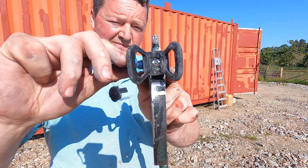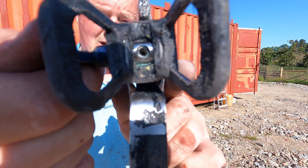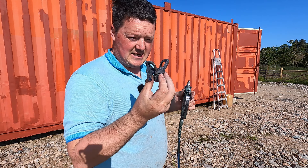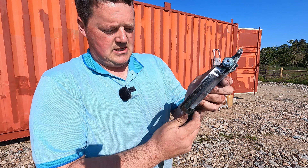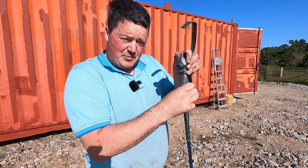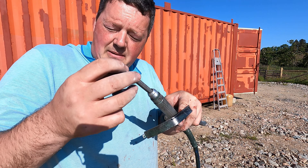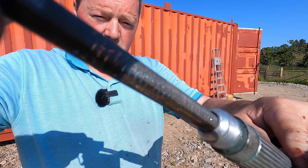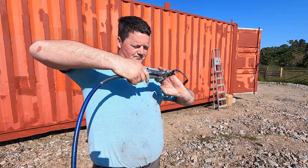That's you spraying. Whenever you get a blockage, you just turn it 180 degrees - spraying, unblocking, back to spraying. I'm going to take and clean that out because this is a key element. It's not too bad, it is sitting centred - I'll give it a wee extra clean anyway. There's a filter inside the head of the gun. That spray tip is a 517 jet - real standard, it's a heavy coarse one. 5 is probably for 5 micron, the 17 is for 17 inch spray fan, about 15 inches of it working. That's a coarse gauze - I tried to get a fine gauze but I didn't have one. Hire company - just keep it all standard.